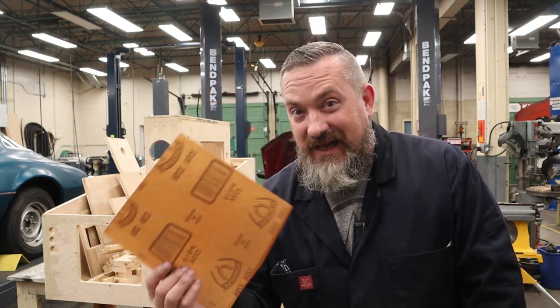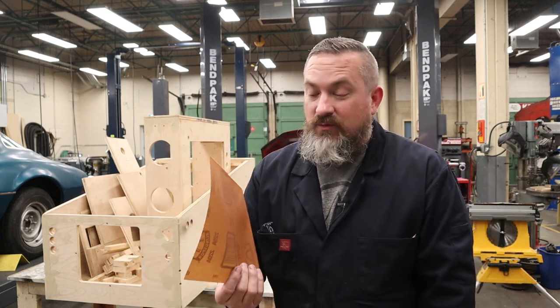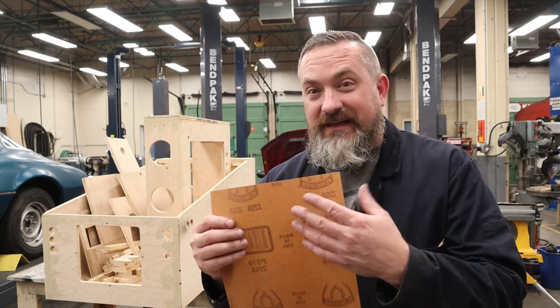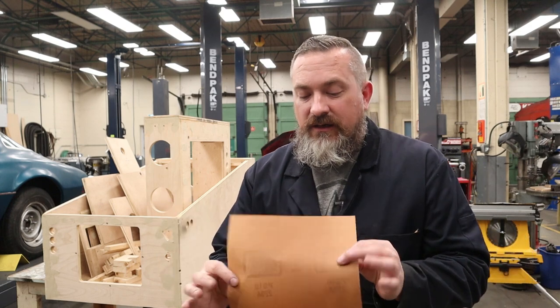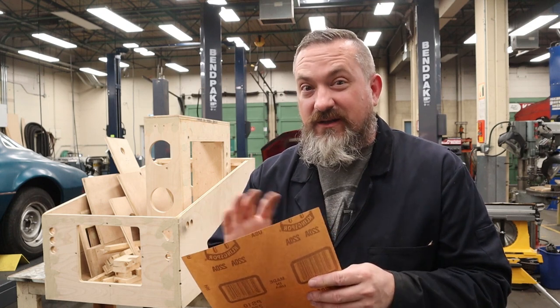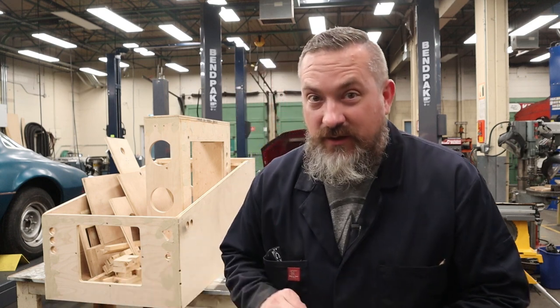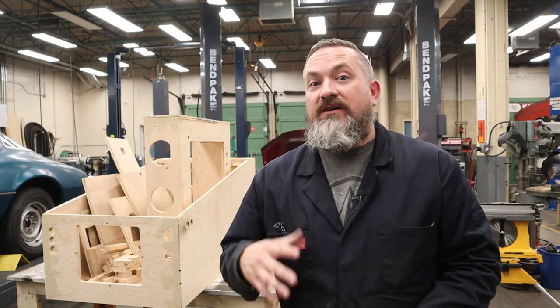This will be the last sanding that you're going to do, and it'll give a very, very smooth finish. It will take a little bit longer and it might be prone to getting plugged up with dust. So either keep it clean and make sure it doesn't have any chunks of wood sawdust built up, otherwise that can cause some scratches. One other grit you might possibly want, saved for the very final sand on top of paint, is 400 grit.